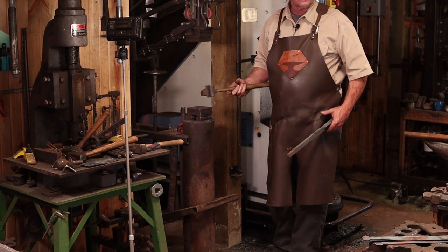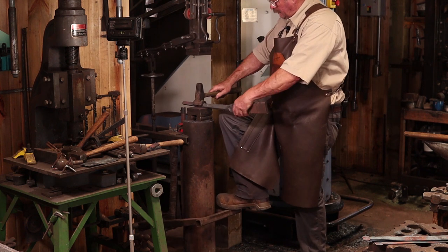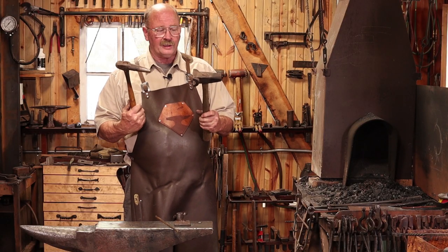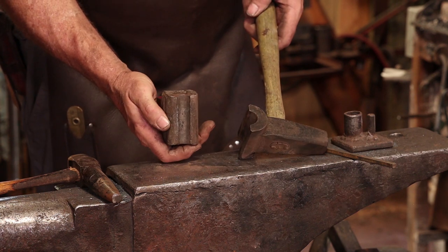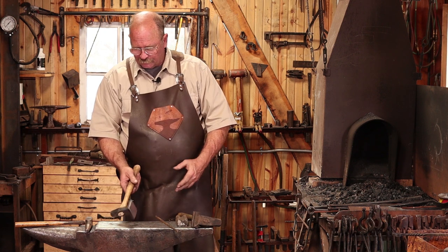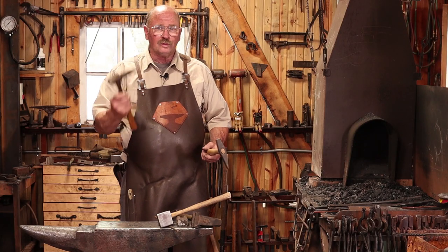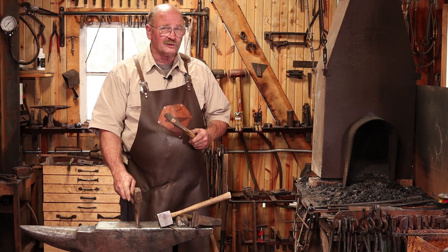What do I do if I need a striker? I resort to this tool called a treadle hammer — it has a foot treadle that swings the hammer head up and down. I can hold the material in one hand, hold the tool in the other, and strike with the treadle hammer. These handled set tools or top tools come in different varieties: one with a round concave shape is a swedge, often used in pairs; a flatter is used for smoothing things between hammer and anvil; a hot chisel is made for cutting hot material; and there are punches as well. The principle is always the same — they set on the work and are struck with another hammer.